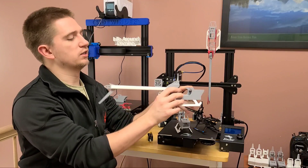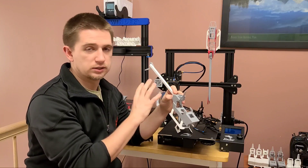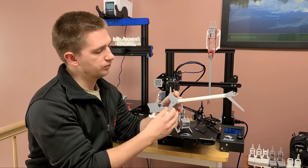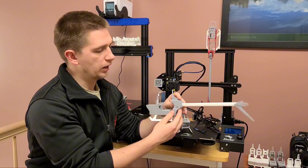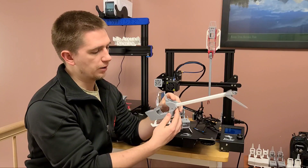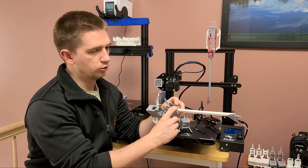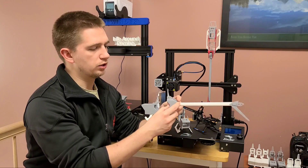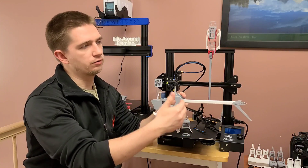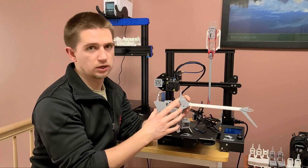I ended up starting with designing the entire airframe from scratch again. I started with the top frame, began removing holes that weren't needed, and after extruding the first top piece frame, I mirrored that and extruded a tail boom block. You're pretty much drawing the dimensions of one part on top of the other, and you just kind of build onto the airframe itself in CAD.